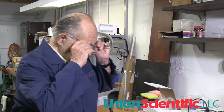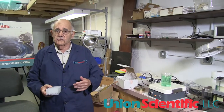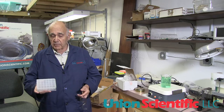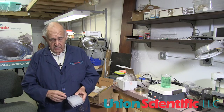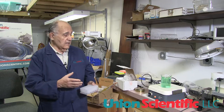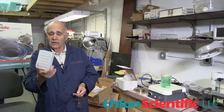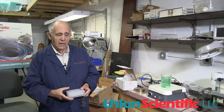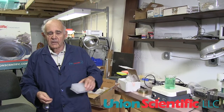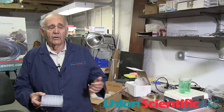To complicate matters still further, many years ago somebody said we can't use beakers for testing large volumes of samples, so they designed the platform called a microplate. Many of you watching this know what a microplate is. Some of the first microplates had 24 wells. There are some with only 12, as a means of saving all the glassware they'd have to throw out. So here I have a 24-cell microplate, and these guys take it and put it on an orbital shaker with an orbit of an inch. But nobody seemed to realize you can't put something on an orbit of an inch that has a hole smaller than an inch.